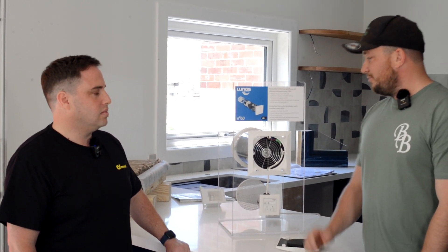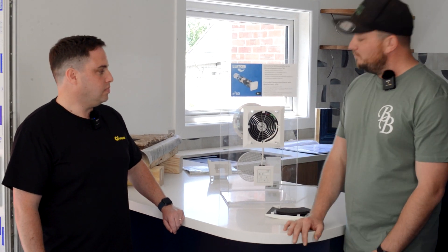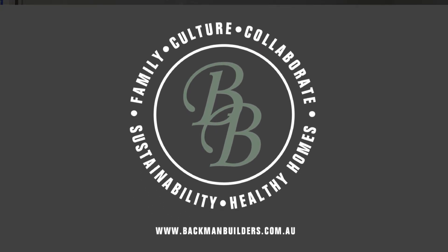One thing that's been great working with AmpVault is you've been lending advice and education to our electricians, and any questions — you guys are only a phone call away, which is fantastic. At this price point these are really competitive. As we all know, it's getting more expensive to build, and yet these are functional for when you're building more airtight — at one to two air changes an hour or lower, which we are here. It's a win-win and we'll probably see more of these. Excellent — awesome, thanks mate.